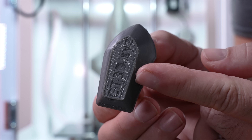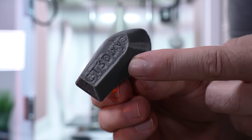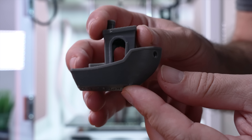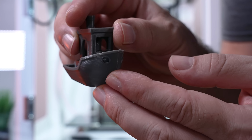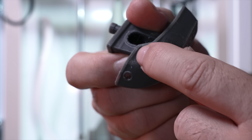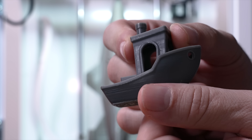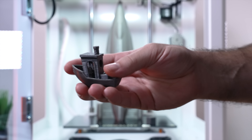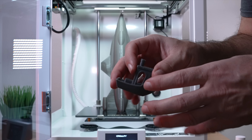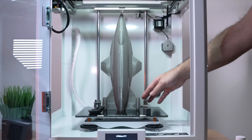The Benchy is more interesting. The bottom looks good. I used some glue because the first Benchy popped off — I might not have been close enough to the bed, so I lowered the Z offset by 0.1mm and used a tiny bit of glue stick. Because we printed PETG at 230°C it appears a little hot, but overall looks pretty good with very minor layering. The box on the back looks good, walls are decent, slight stringing. I think retraction needs to go up to about 7-7.5mm given the long Bowden tube. Also the lighting/reflections make it look worse than it actually is.